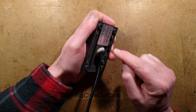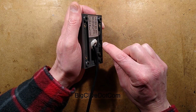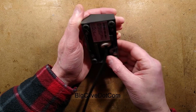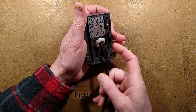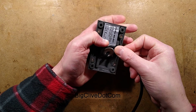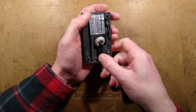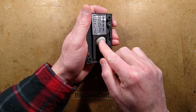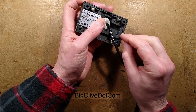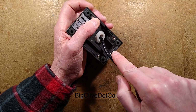We have the standoffs, the screw mounts. We've got a couple of removable indents here for the cable coming in from the top. I wouldn't recommend bringing the cable in from the top. If you did, I'd recommend putting a loop in it like this if you could, because that's just basically going to guide water in, and then rely on this seal to keep the water out.